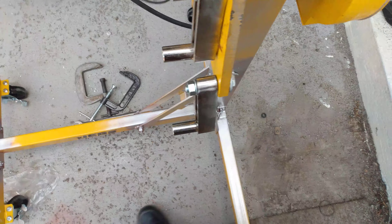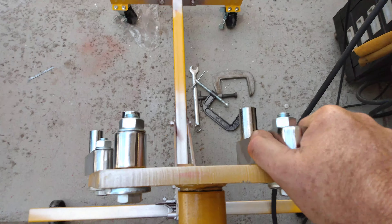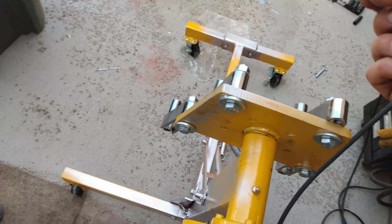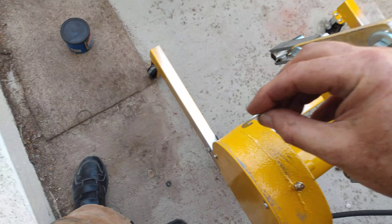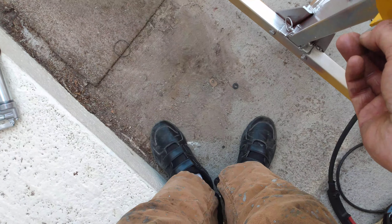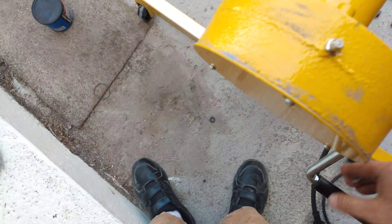Three, this is going to have lots of slop like you saw in my first video. You can see I got rid of all that slop by taking one of the washers that I didn't need anymore because I welded. I cut a notch in it and I stuck it right in front of the screw worm here, right in front of the washer that's next to the bearing — because there's washer, bearing, washer.